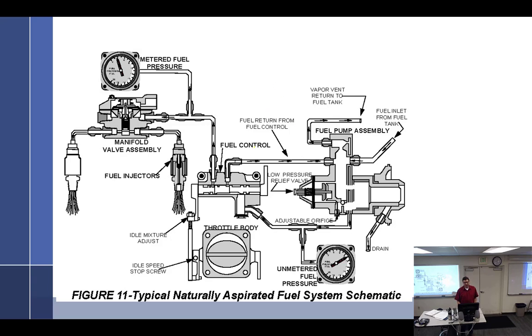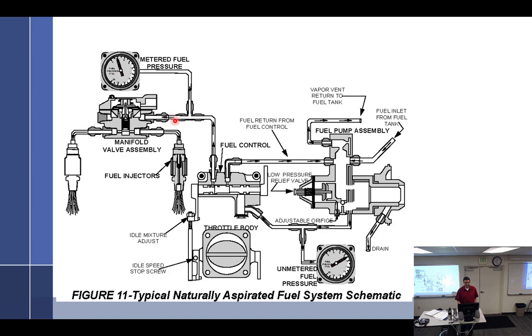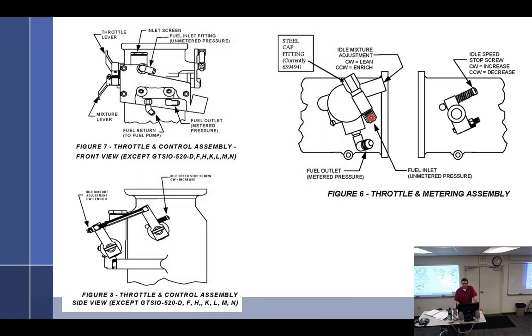Following the instructions in the manual, there are four adjustments: two that you should not touch unless you have the gauges installed, and two that you can freely touch. In this particular system they've put in a T fitting right here. Sometimes you'll have fittings that are blocked off — they'll put a T fitting so you can have two hoses, but you'll see one has a cap on it. That's where you hook the hose for adjusting the fuel system.